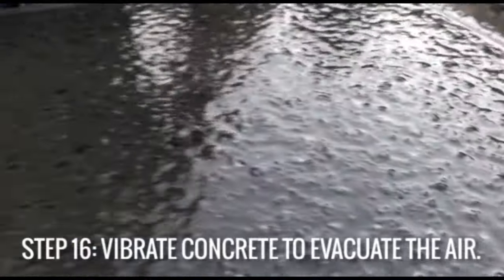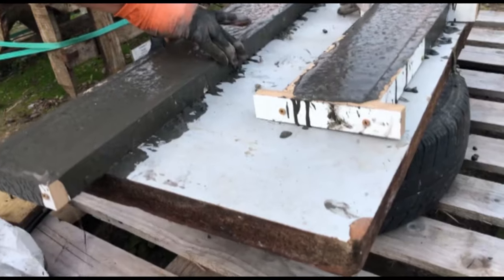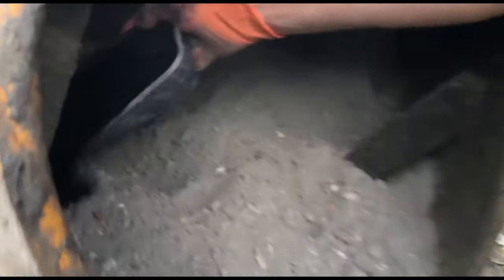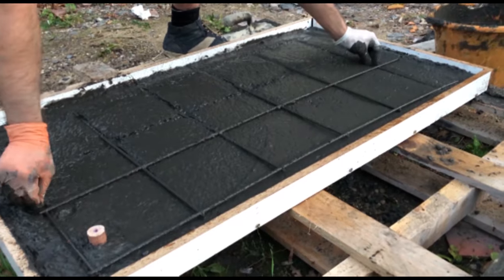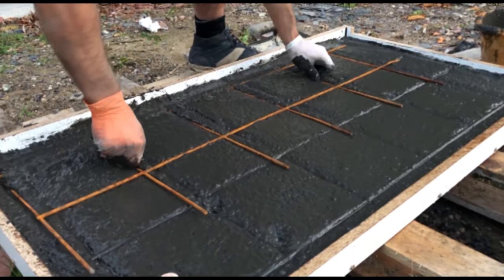It's really important to vibrate the concrete as much as possible to get rid of the air bubbles — this will make sure the concrete is super strong and super smooth. If you want to make a vibrating table like the one in this video for under 50 pounds, subscribe and I'll show you how in my next video. This is now the second mix with four percent pigment for the kitchen worktop, and we've also got a piece of shuttering to make a lip at the front edge.